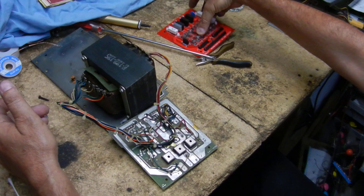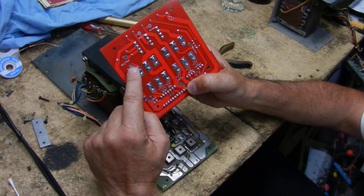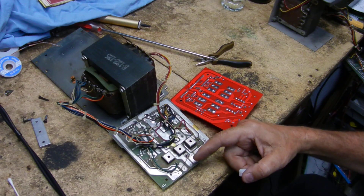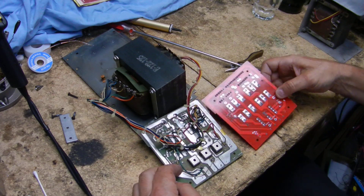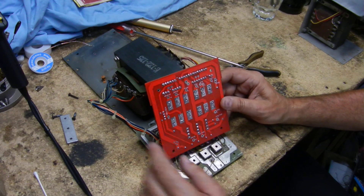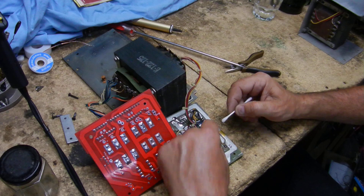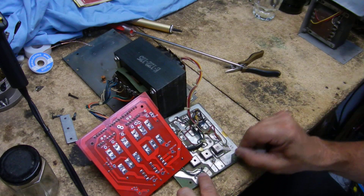It's upside down. These guys have actually written down the wire colors: white and black, green, red, white and red, black, blue, red, white, green, and orange. I'm going to get some water - it's hot today. You're going to verify the workmanship. You can see that's green, that's your white and black. If your wires are pretty dirty, get an earbud, put some isopropyl alcohol on it, and wipe it to get rid of the grime off the wire if you can't see what color it is. Clean it up with a bit of iso.